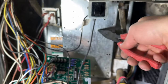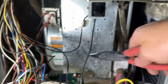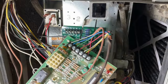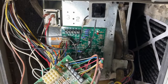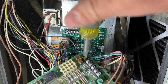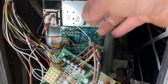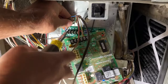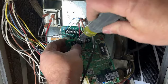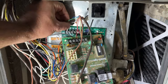This new board comes with new little plastic tabs, so we're just snapping these old ones off. The last thing we have to do is transfer over the T-STAT wires, and we're going to do these one at a time, the same way. Blue and white will go to our C terminal — let's snug that down. And G is going to be our green wire, so we'll take that and move it over to G on here.